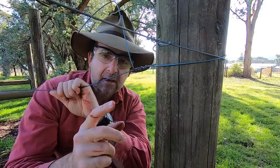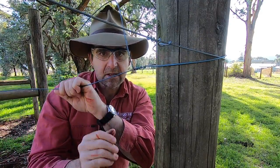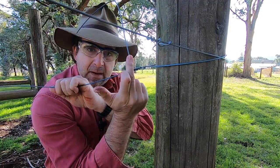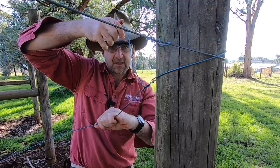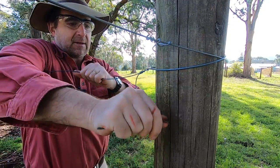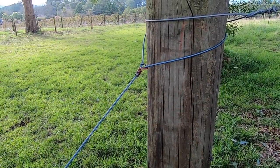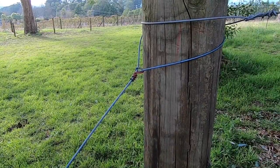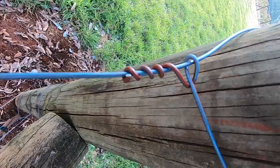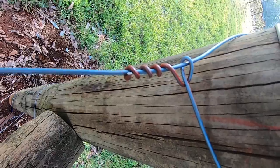Now I'm going to show you a trick that does away with the need for pliers. Because I'm dealing with high tensile wire — medium tensile wire will work fine too — I've already bent this wire in one direction. If I take my crank handle and bend that at 90 degrees, and then spin it around this way, the wire breaks straight off. You've broken it with your bare hands — don't need pliers to finish the fence. Now that we've tied off our wire, I'm free to run it out, tie it up at the other end and strain it up. Look out for some more knots in future videos, where we demonstrate tying them and then we strength test them.